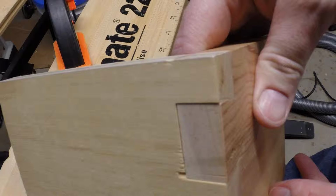There's a little bit of tear out there also. To remedy that, when you cut your pinboard, you want to do a little bit of a back route as your first cut, a very shallow back cut, and then cut into the joint, and then that'll eliminate tear out on that. You can also use a marking gauge to score the wood, but then you'll see your score marks, and you may or may not want that.